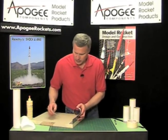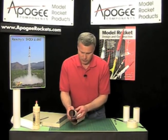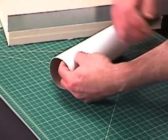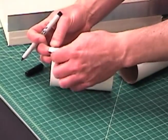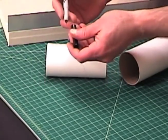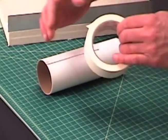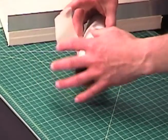Now we're going to take a tube that's not been cut yet and slide this inside like that, and then we want to spread it open. I got it most of the way in, then spread it open as far as we can, and you're going to take a pencil and mark the tube showing how much it is overlapped. Here's our overlap on the tube, and now we want to put it on the outside of the tube — the reason is we need to draw a nice straight line down the tube, and right now the tube is kind of wobbly.